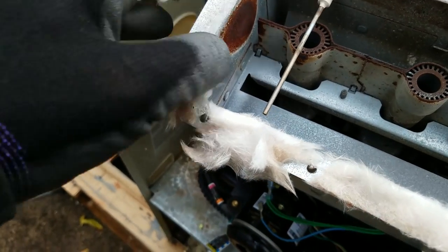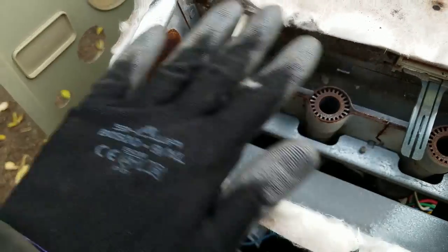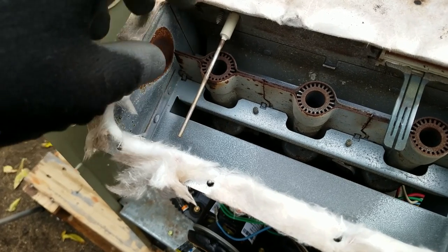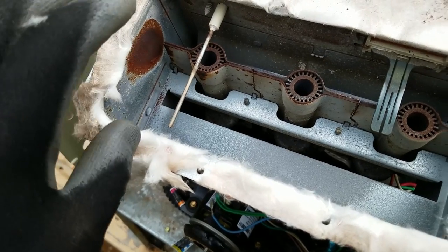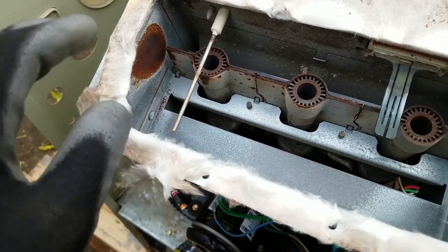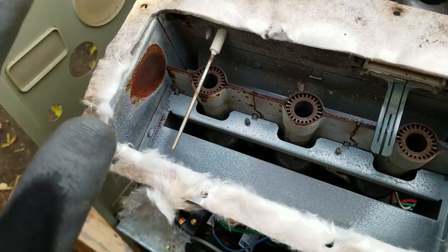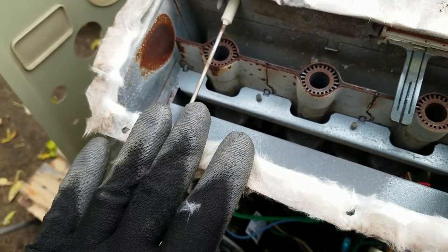This is the flame sensor, and it detects when there's a flame in the actual combustion chamber here. There's a very high voltage on here, and they measure the current between this high voltage and the grounding of the combustion chamber. When there's no flame, there's very, very little current. It's basically nothing. But when there's a flame, it ionizes the air, or the combustion gas, and it actually draws current. It's not very much, but they can tell from that amount of current that there's an active flame in the combustion chamber. It's really neat technology.